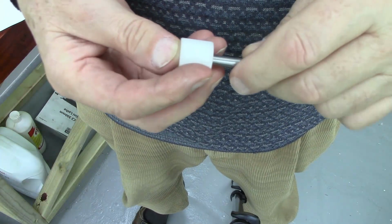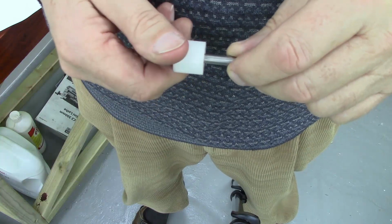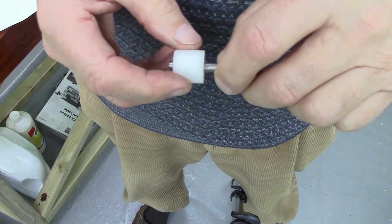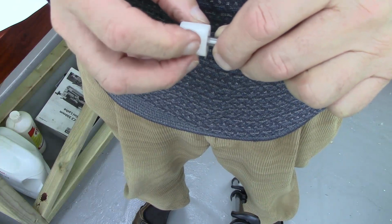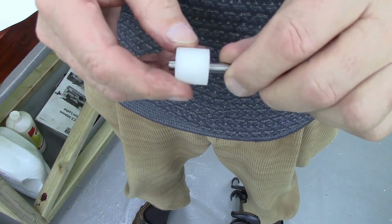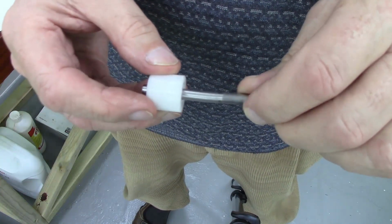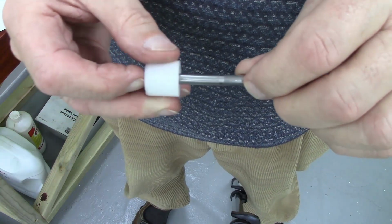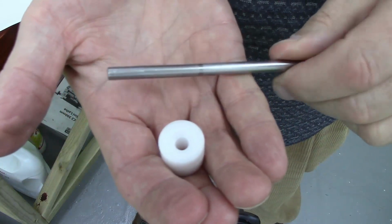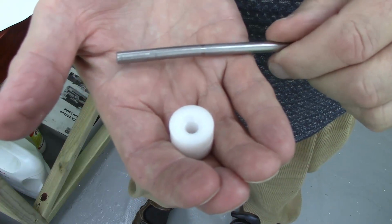I had an accident with the mini lathe yesterday. I was turning a piece of Delrin, a Delrin bush like this, not this one, but actually a smaller one, and I had put this piece of stainless steel rod inside it just so that I could clamp the chuck down without squashing the Delrin. And anyway, somehow the workpiece flew out of the chuck, and this stainless steel rod got caught on the cutting tool, and it got bent, as you should be able to see. Yes, it got bent. So quite a lot of force must have been applied to something, somehow.